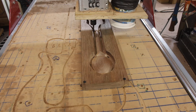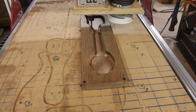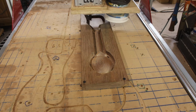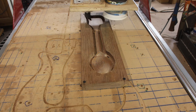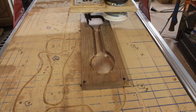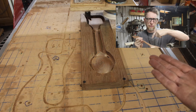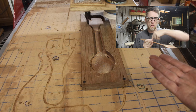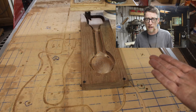The final profile cut was kind of screwy, and I think it was because I had applied it to the model shape instead of just cutting air and running around the profile. It kind of took a long time and I ended up stopping it because it cut all the way through anyway. The reason the tool path was weird is because I had applied it to the 3D model, so it was following the contour of the model as it went around — you don't want to project it onto that, you just want a straight cut going around. That has been fixed in the file you'll get to download.